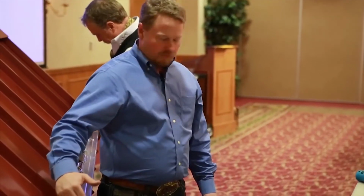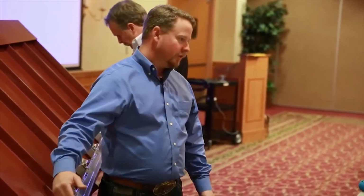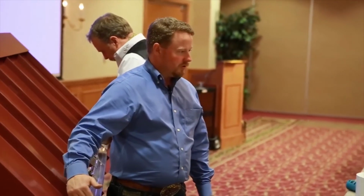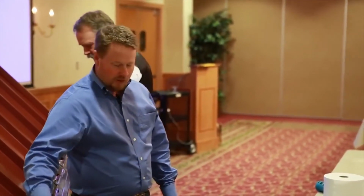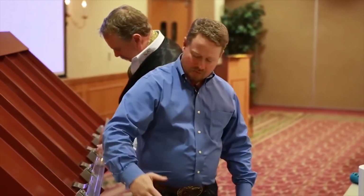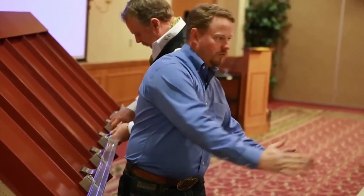So you would come back with your reciprocating saw at the end of your assembly. Now, you wouldn't have started it this way. This would be the end of the assembly at the other end of the roof. And you make sure it's within 4 inches of the edge of the clamp. The reason for that is you leave this out here and it's weak, so it can precipitate a failure all the way down because it gives that weak spot to start pulling the whole system.